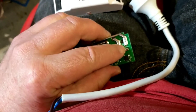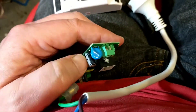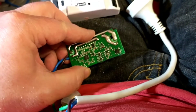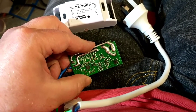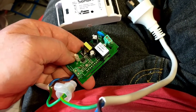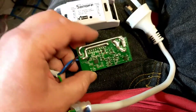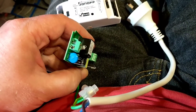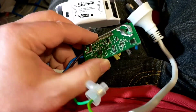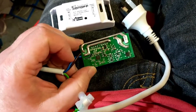Even though they've got a ton of solder on the connections, it's not actually holding the pins, and the terminals will move inside the solder, which is in my opinion pretty dangerous because you're going to end up with high resistance joints and all sorts of issues — and you've got these things sitting in your ceiling or wherever else you're going to put them. That could cause potential electrical fire issues depending on the loads you're running, because they are supposedly rated at 10 amps at 230-240 volts.